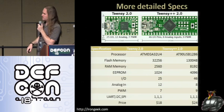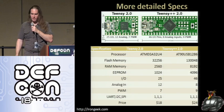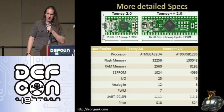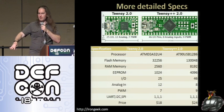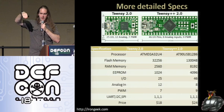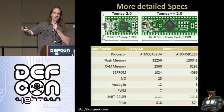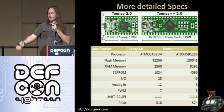Here are the basic specs of both the Teensy and the Teensy++. Generally for most things where you just need to send keystrokes, the Teensy 2.0 by itself is enough. If you need more room for payload, look into the Teensy++ 2.0. It also depends on how many analog inputs and pulse width modulation outputs you need. That glowing effect you saw earlier is caused by PWM — it turns a connection on and off really fast, making an LED dimmer or brighter. I have three going: one for red, one for green, one for blue, so I can simulate any color and fade through them.